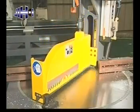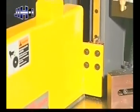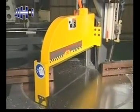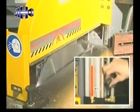Independent cylinder with linear guideway for up and down material pressing. This design allows for independent adjustment of clamping pressure to prevent the distortion of the materials caused by overloading, independent adjustment of cutting speed, and clamping speed.